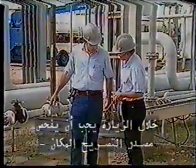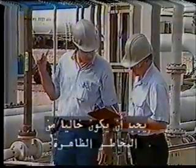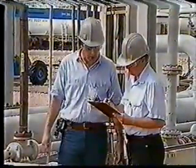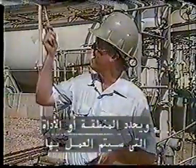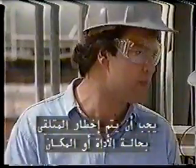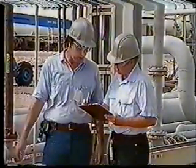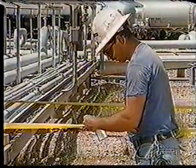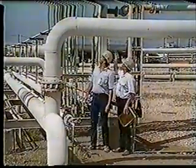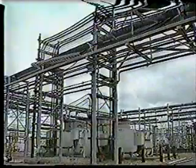During the visit, the issuer should check out the area to make sure it is physically safe for work to start — free of any obvious hazards like chemical leaks or deteriorated equipment. The issuer should point out exactly what needs to be done and identify the specific area or equipment to be worked on. The recipient should be informed of the status of the equipment or area, including what steps have been taken to prepare it for work. In some cases, it may be necessary to mark the equipment or area to avoid confusion. The issuer should also warn of any local safety hazards — within the equipment itself, such as chemicals, or in the general area, like high voltage lines.